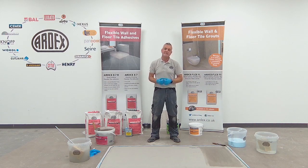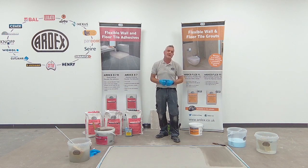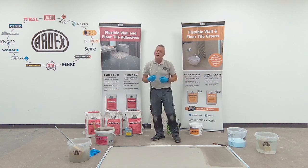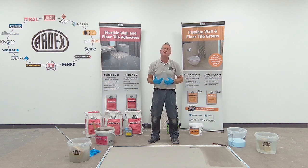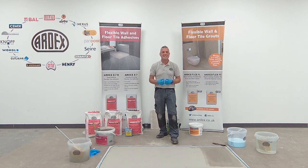If it's standard setting, it doesn't mean that because it's hot temperatures you must not use that product. Ultimately, with a lot of products, a lot of backgrounds, lots of situations, standard setting DCs will be suitable for those applications. Within the ARDEX range, we have a series of standard setting products, such as X7G or X7W, which is your grey and white. These are standard setting adhesives, which have maximum pot lives of 5 hours. So you can mix the full bag, even during 20, 25 degree temperatures, and you will still get a good pot life. Not necessarily 5 hours, but you still have an optimum chance of using the full bag in that time scale.